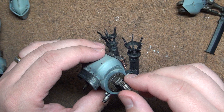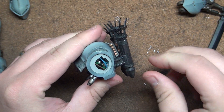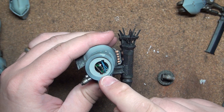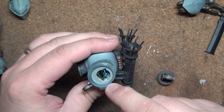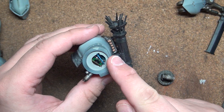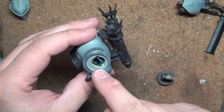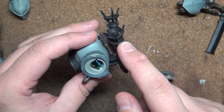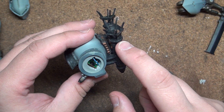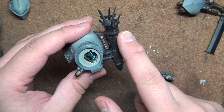So that got me the wires into the torso. I haven't glued this side piece on yet, so let me take that off and you can kind of see. I put this on a drill press because this was a solid piece, and I put a half-inch bit all the way through the torso — it came out this side here, and inside you'll see where the wiring is. You'll also see a little circuit board. The LEDs I used in here came out of one of those little flickering votive candles — I wanted to keep that flickering effect. So there are actually two small circuit boards stuffed down in here, and that's what allows these to flicker.